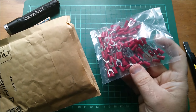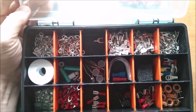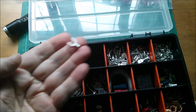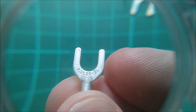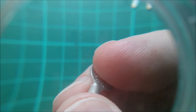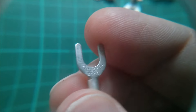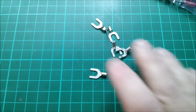This is from a UK seller and it is fork crimp terminals - yes, it's the fork terminal saga. In my crimps box I've got all these crimps which I bought some time ago from Rapid Electronics, and the one I use mostly - I've got one left. This is the terminal, it's a KS 1.25-5L. The 5 at the end is a 5mm span between the two forks, the 1.25 is the hole in the end - a particularly small hole, good for the gauge wire I'm using, 22 to 16 AWG. KS is KS Terminals in Taiwan - really nice quality, really thick. But Rapid Electronics have discontinued these, which is really annoying.